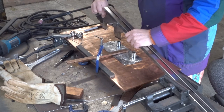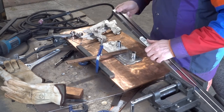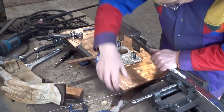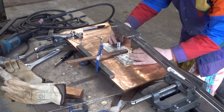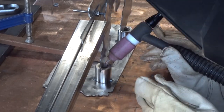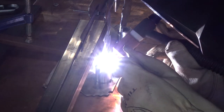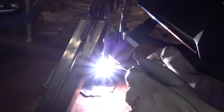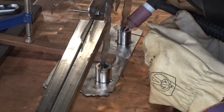Now I am putting together the rigging to hold the sculpture to the base. The rigging is comprised of a vise and some pieces of square bar steel that will hold the sculpture upright as I rest it onto the stanchions on the base. That allows me to keep both of my hands free for the welding. In the past I would try to hold it with one hand and weld with the other, which courts disaster. I've also tried welding the top piece while holding it steady with my chin, but that means I would not have visibility to the weld. This is a great compromise — holds everything rock stable with no fear of the assembly falling into my lap while it's still hot.